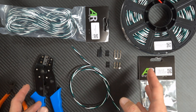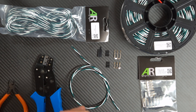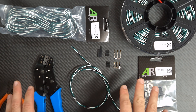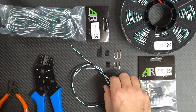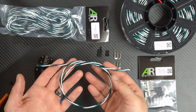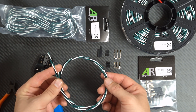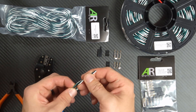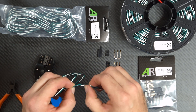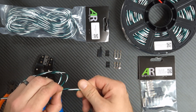I have a basic layout here. The process is exactly the same for the 20 AWG as well as the 22 AWG wire, whether you get the aerospace or the aerospace light. One reason to use a wire like this is it's so much lighter and better for our models. It's thinner, even though it carries the same current. It's lighter because the sheath is so thin, and it's abrasion resistant as well. You can actually try and scratch it with your nail, and you'll find that it won't do much to that coating because it's a PTFE coating.